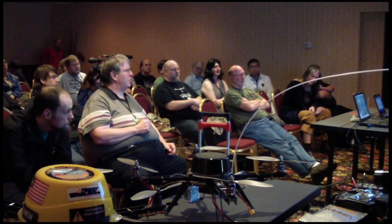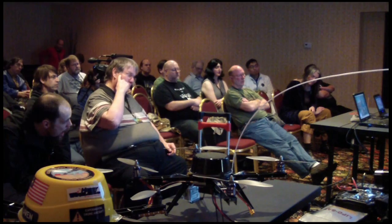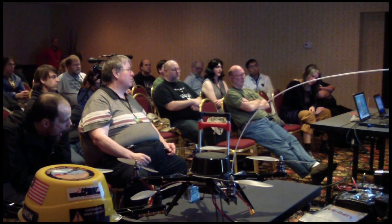To return to your question, like Brian said earlier, it's essentially fly-by-wire. You're not saying, okay, propellers 2 and 4, speed up a little bit. You're just telling it, hey, go left with the stick, and the little brain on board is making all the calculations. Okay, we're going to drop the RPMs on these motors a little bit, pick them up over here, and that's going to pitch it over like that. It's doing all that, did you say like 400 times a second? Yeah, that's each motor currently. So if you want to go this way, these two speed up a little bit, these two slow a little bit, and it maintains that as you're holding the stick over. Let go of the stick, it goes back to normal again. And same with forward and backward.